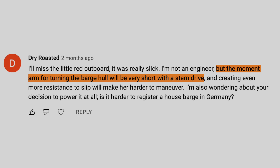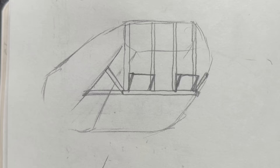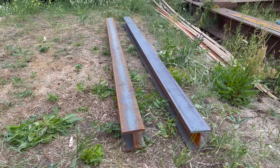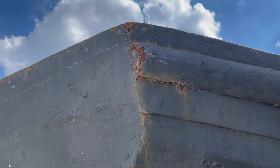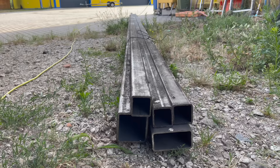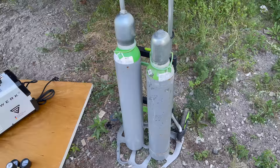While I was thinking of what would be the best way to do this, I came up with different concepts, but in the end, with the advice from a good friend, I decided to simply build it as solid and simple as possible. The main structure will be composed out of four vertical beams. For this I'm using 100x100mm H-beams, and in order to get an even surface where to attach them, I'm gonna build a rectangular frame which I'm gonna weld onto the stern of the ship. So I got some fresh steel.